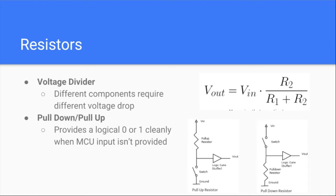Really quickly — if the base voltage is zero and the emitter voltage is also zero, will it be on or off? It'll be off. Now let's say we hook up the MCU — the MCU applies 3.3 volts or zero volts. What happens if we set this low? The transistor is off. What happens when we make this 3.3? It's dangerous — we're making a short circuit from 3.3 to ground from the MCU — that's pretty much pulling max current from your MCU. So instead, put a resistor right here and make it really large, like 47K. Now when this is low, this is also low — there's no issue. When we make this 3.3, the entire voltage drop is across the resistor, and your transistor still sees 3.3 volts, so it turns on.